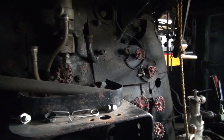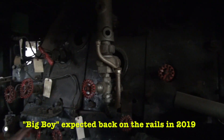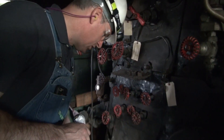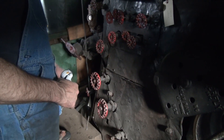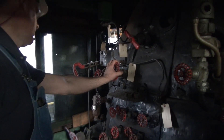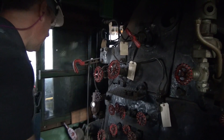A lot of sitting. All this will go away. This is the coal firing steam jets here. These are the clean outs for the ash pan. We'll redo this with an oil firing manifold. We'll probably keep this — or this one will be the blower. And we'll rearrange all this and put a nice firing manifold here.